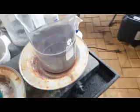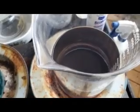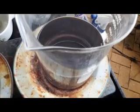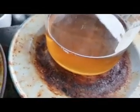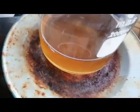That's the last of the first three water washes. Now I need to pour that out, and I'm going to boil it now with hydrochloric acid. And this is important, I don't just rinse it with hydrochloric acid, I want to boil it. Helps to cook out all the other things like copper and bits and pieces that are in there. Okay, I put hydrochloric acid in there. Now I'm just going to let it boil, and I'm going to boil it for about an hour at least. And then I'll tip it out, we'll go from there.